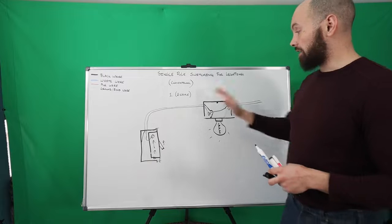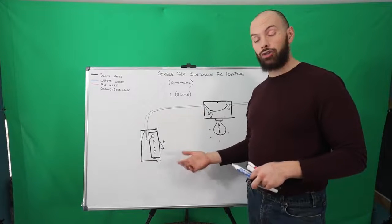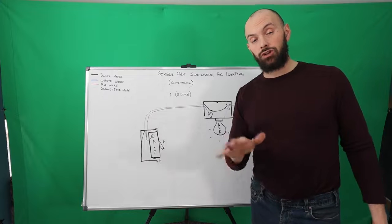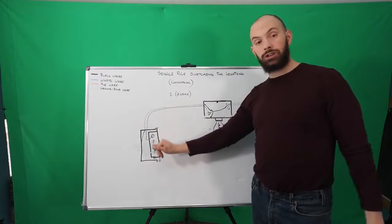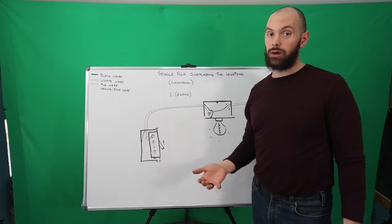Hopefully this covered everything. The next video I'm going to do is also the same wiring. However, we're going to be putting down a 3-wire because the new codes require that you put a 3-wire wire down from your box to your light for the new smart switching that is out on the market nowadays.